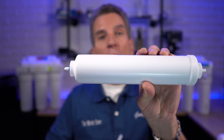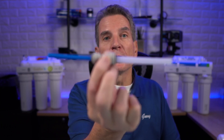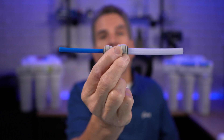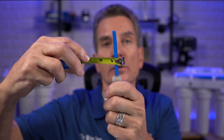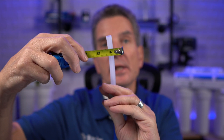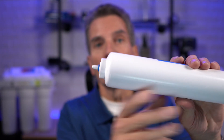So let's figure out what you need for your system. If you've determined which kind of post carbon filter you have — the kind with quick connect fittings on the end — then you'll need to know what size those quick connect fittings are. The most common sizes in reverse osmosis systems are three-eighths inch and quarter inch. You can simply measure the outside diameter of your tubing with a tape measure. If it's a quarter inch, look for a filter with quarter inch quick connect fittings; if it's three-eighths, look for three-eighths inch fittings.